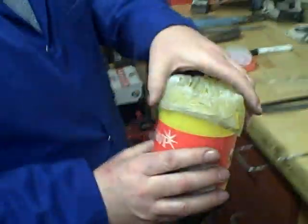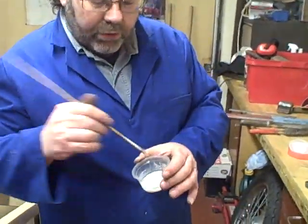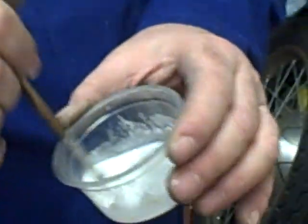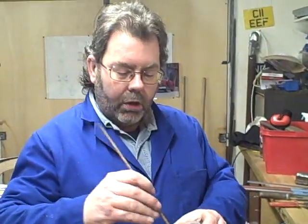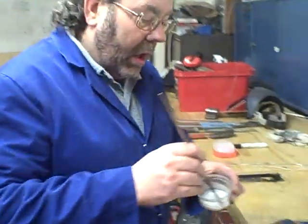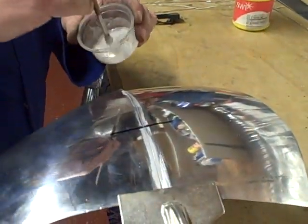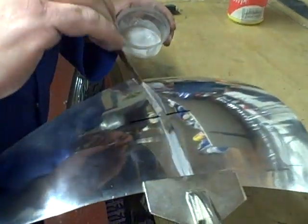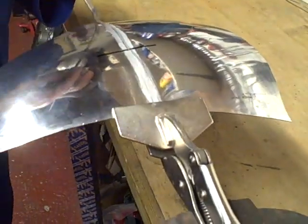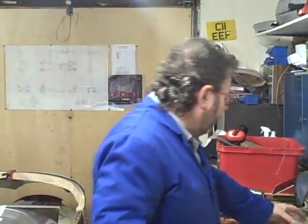It's open now and ready for use. An additional trick is to mix some of the powder with a small amount of water to make a paste. When it's newly made up it works perfectly, but if it's left for a period of time it doesn't work. So using an artist's paintbrush, we've already filed and wire brushed the metal, and now we're going to paint some flux on. We don't need a huge amount, but you need to be thorough that the edges are coated. That just helps the process — we've made a paste from the flux with a small amount of water and applied it.